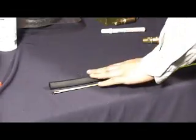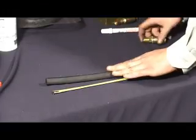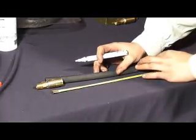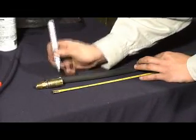Your first step is to determine the length of hose you need for the project. Make sure your hose ends are cut square. You will also need the fittings to crimp onto the hose. Place the fitting above the hose to mark the hose end point, and mark the hose where you want to place the fittings.